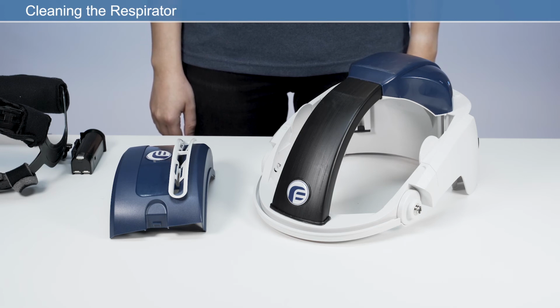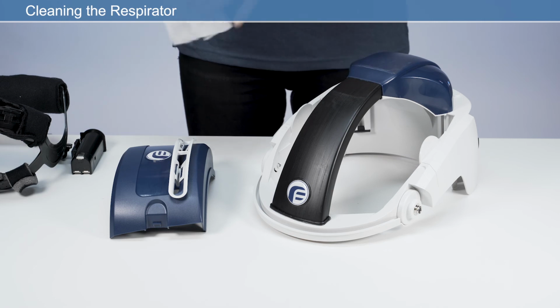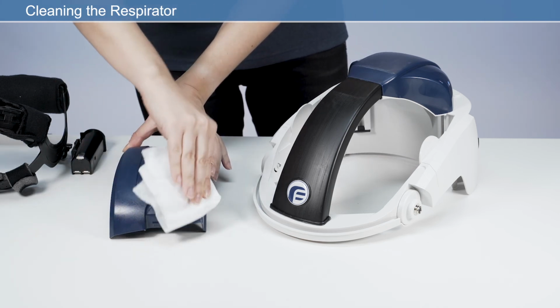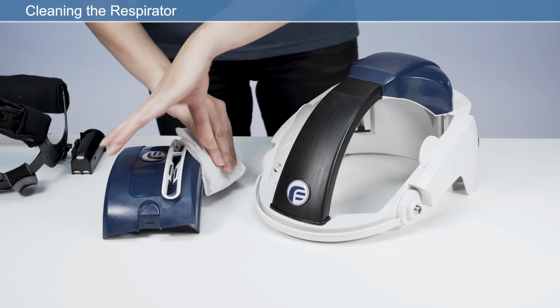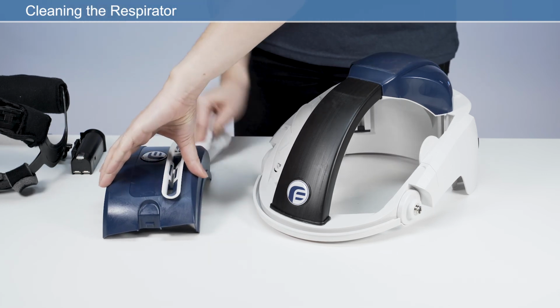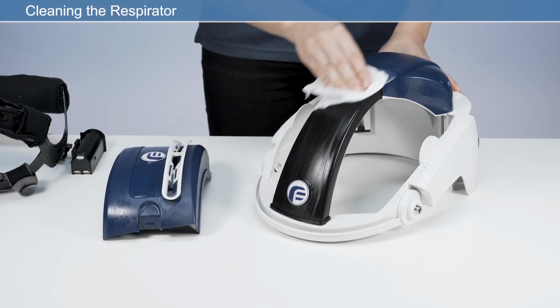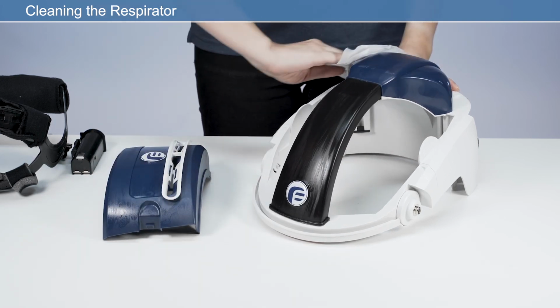Dry the respirator with a clean, lint-free cloth. Do not use a heat source. Wipe the inside and outside of the respirator. Pure Wipe cleaning wipes are recommended for this purpose. Do not immerse the respirator in water or any fluid. Do not use organic solvents or abrasive cleaning agents on any part of the respirator.